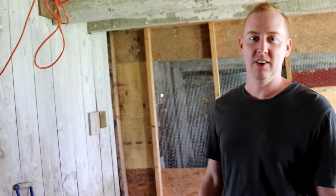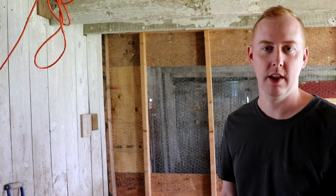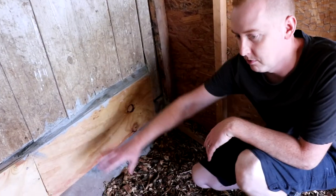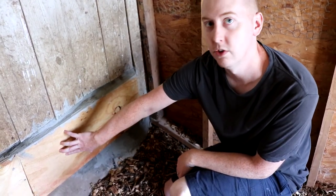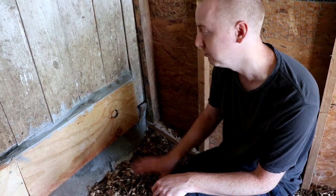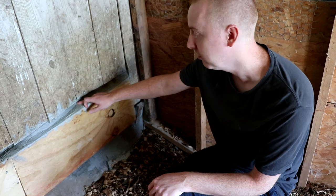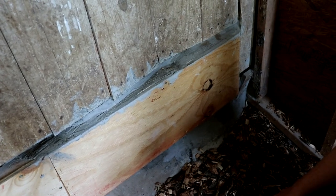It's an old barn, so as you can imagine there are a bunch of holes and gaps everywhere. The biggest problem was critter-proofing it, especially when the chickens are young. We tried to fill any gap bigger than a quarter inch, which took quite a while. Down below is a sloped concrete pad with a drain in the middle. The old rotten sill at the back was boxed in, and any large gaps got hardware cloth and then mortar to keep rodents from chewing through and getting in.